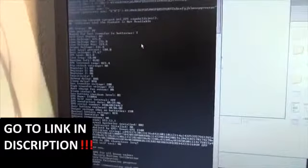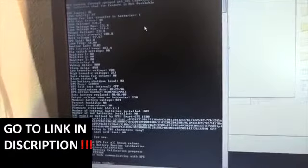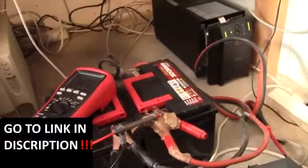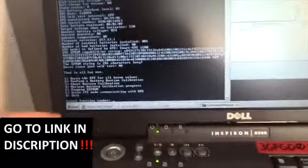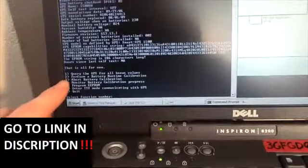These UPS units have a function to essentially count with wear leveling, so the battery constant changes with time even if you don't run a battery calibration. I'm suspecting this UPS has overcompensated because I would think I'd get more runtime out of these batteries. So I'm going to use apctest.exe and run a battery calibration while I'm doing other stuff around the shop - battery runtime calibration, press 2, let's see if it works.